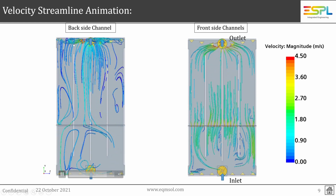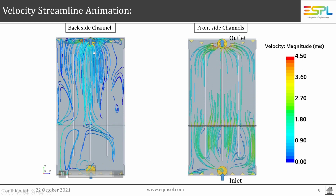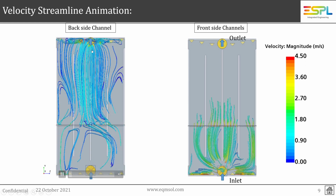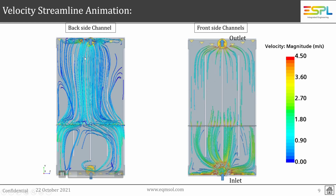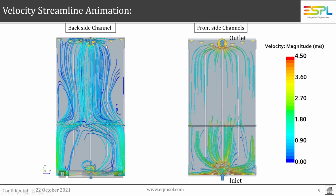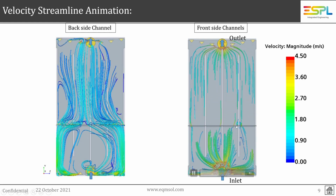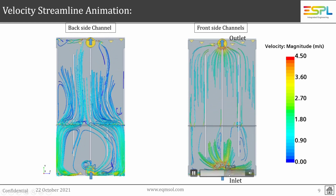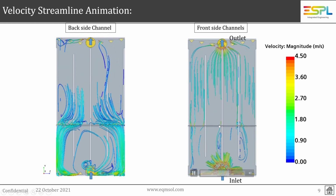Here, if you look again how it goes out from the chambers, it works quite well, but still most of the air is going through the center of the holes. But that's mainly caused because air will go the easiest route, and now there's too little airflow going here, so that's why it's not flowing so nicely there. I will do more calculation on the hole sizes. I think I will add more holes to the entry side to get better distribution before the baffle plate.